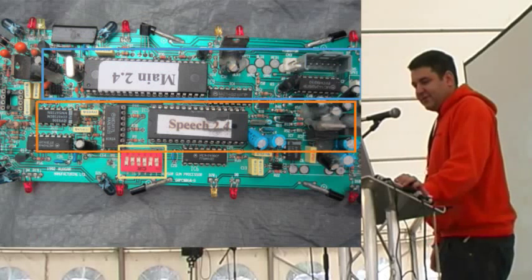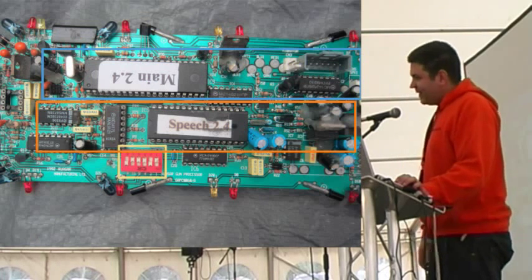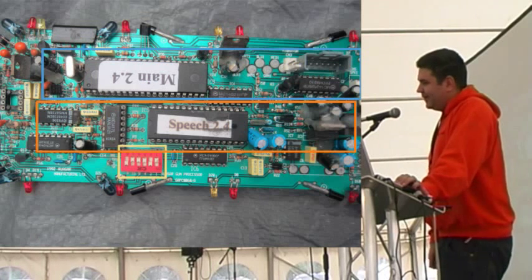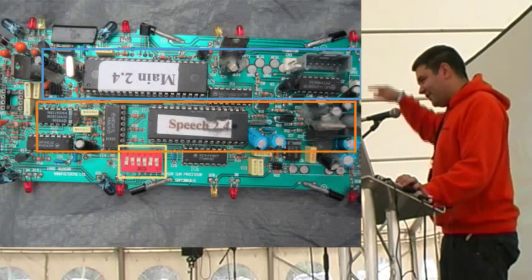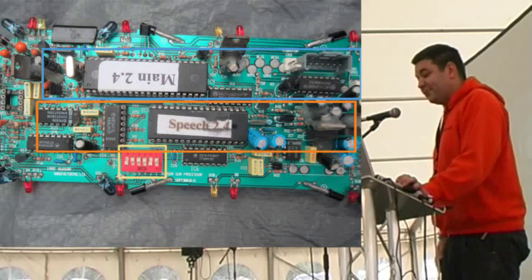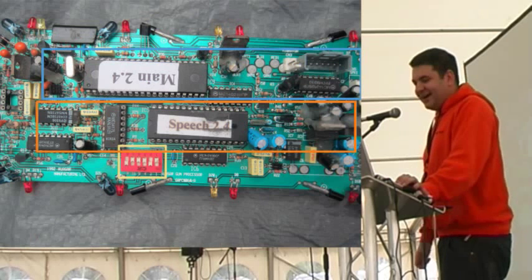The yellow section is the speech - pretty much half the board was dedicated just to the audio. The way it did this was quite clever. It actually used technology taken from telephone systems. The chip going vertical on there is actually a CVSD chip - continuously variable slope delta. Basically it draws a line up and down based on ones and zeros: a one makes it go up and a zero makes it go down to produce the waveform. It pulls it all out of that big speech chip, which is just a normal ROM, passes it through various filters into an amplifier chip and out into the speaker. Nowadays you could condense that down to almost nothing with today's modern MP3s.